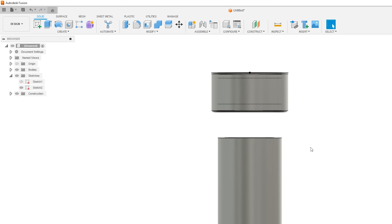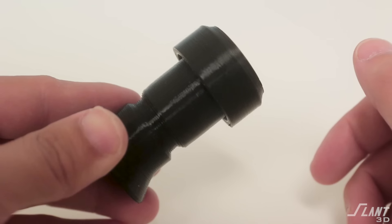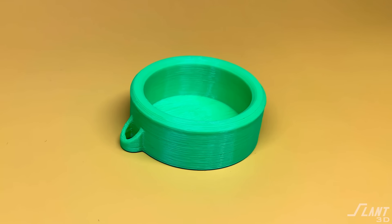In order to design these correctly, you want to actually add just the slightest chamfer into the part. That way the lid definitely has a place to start where it can go on very easily, get a little bit of engagement, and then depending on how tight the user wants to place the lid on, they can press until it's tight enough. This also gives you additional material, because with these friction fits when they pop off and wear out over time you have more and more material to wear away. Whereas if you had a pure cylinder in a tube, once it wears out it's completely done and there's no longevity to it at all.